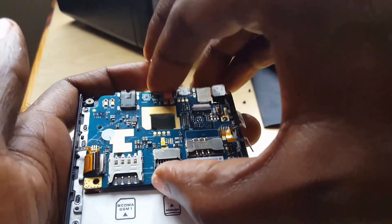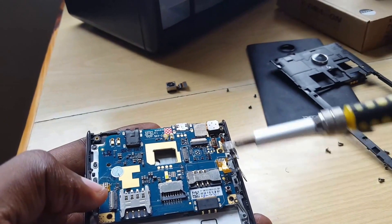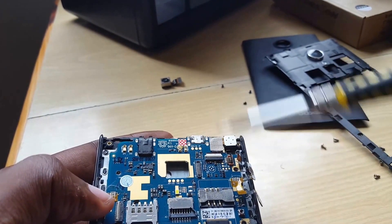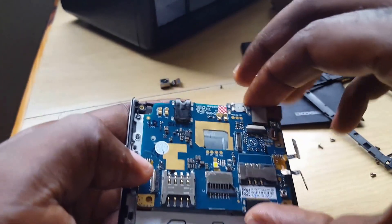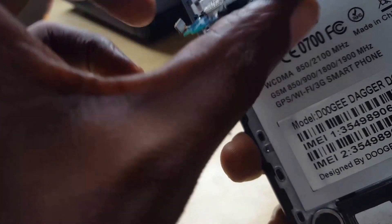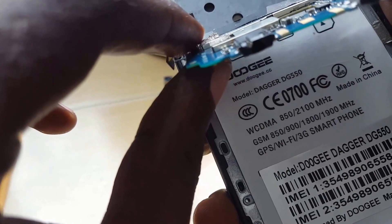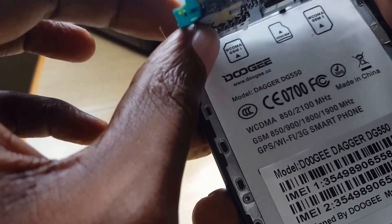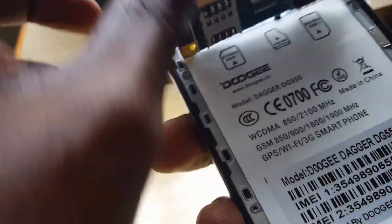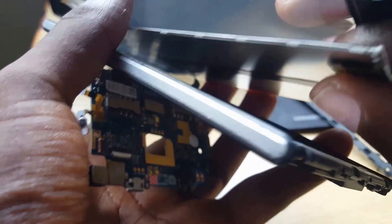The main part of the circuit board will now come right off. There are about three screws here — watch out for one over here, one up there, and possibly one more, so watch for screws scattered throughout. Also watch out for additional connections on the underside of the board. There's a connector on the flip side and one on the lower side. To avoid unnecessary disconnections, I'm going to see if the screen will come out without fully separating everything.